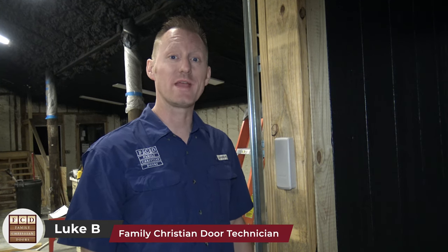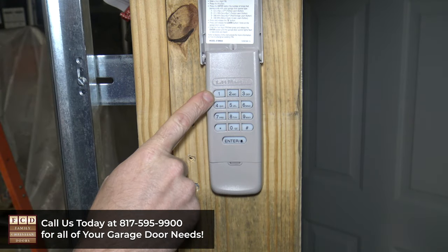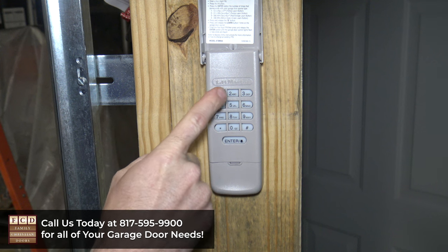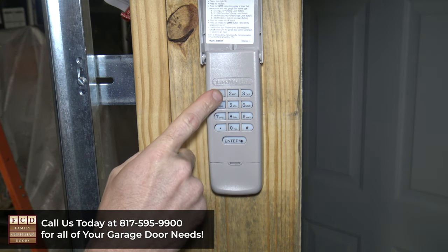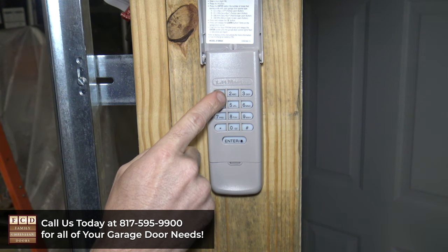Let me show you how to change the code on your LiftMaster jackshaft operator without having to erase anything else that's connected to it. First, you're gonna open the cover. Next, you're gonna enter your current pin. In my case, it's 1111, and I wanna change it to 2222. So I'm gonna put in my pin first,